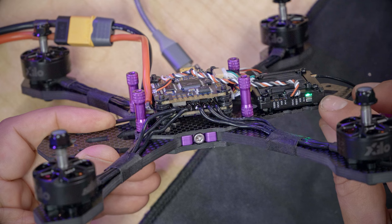But if you have got your goggles for the very first time, they're brand new, then when you go into the channel, for example, do you see seven channels and then a CHP, a public channel, or do you only see three channels there? If you go to settings and go down to bitrate, do you have the option to select high bitrate as well as standard, or do you only have standard? If you don't have those options, then it means you need to unlock your goggles. Here's how you do it.